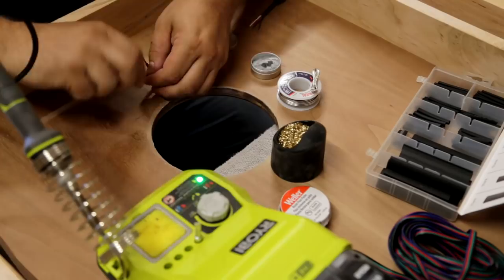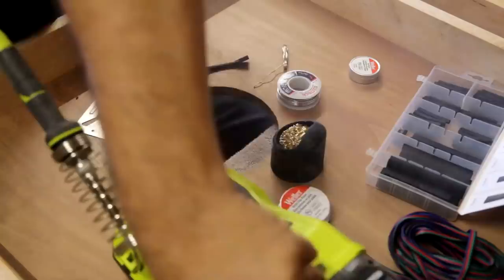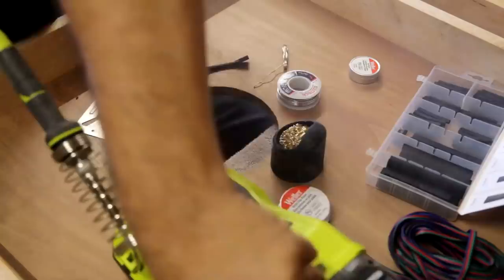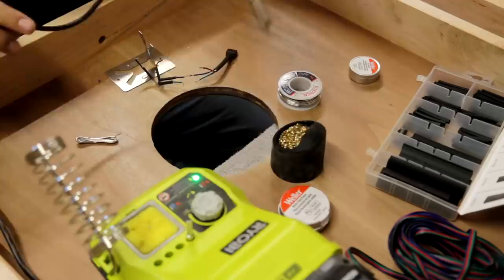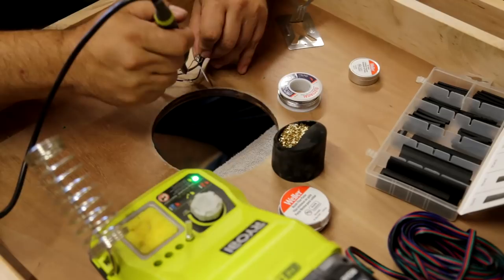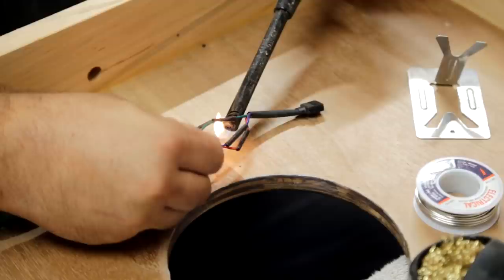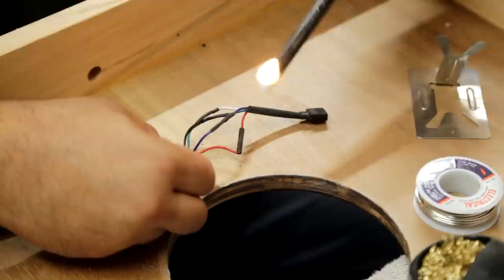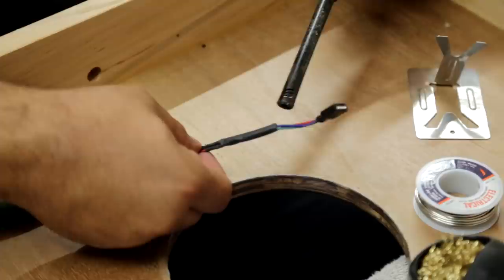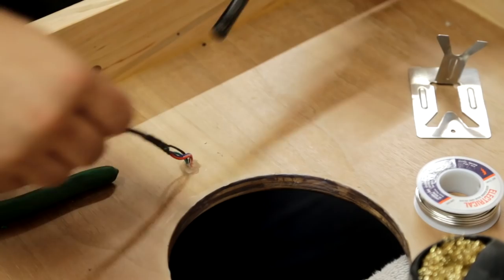Here I'm soldering up the wires I poked through from the LEDs. That little hole next to the wires in the top of the board is where the remote sensor will poke through so you can use the remote control outside — they'll stick it under the board to change colors or patterns. I was trained as an electrician years ago so this is no big deal, but one important note: this board will be outside, might get rained on, or have beer spilled on it. Make sure you use heat shrink — Harbor Freight has a big box of various sizes for about $10.